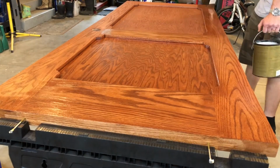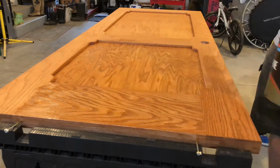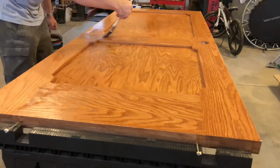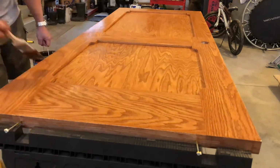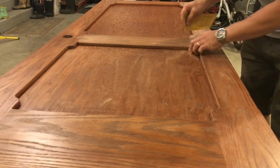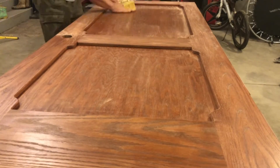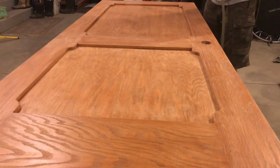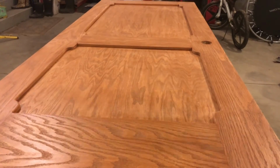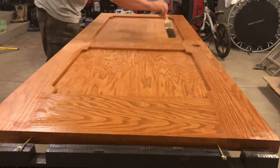Nothing fancy here, just brush application, flip and brush some more. I'm keeping brush strokes consistent with wood grain direction and length. First coat is very lightly sanded with fine grit sandpaper. Here we need to be especially mindful not to sand through the lacquer and stain and expose bare wood. Blow off dust, apply final coat, install hardware.